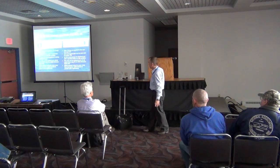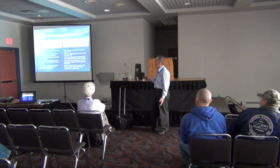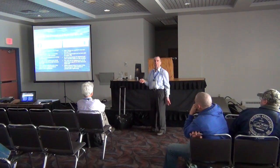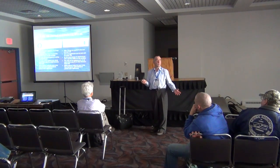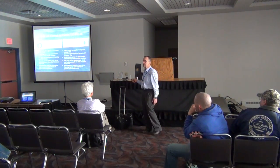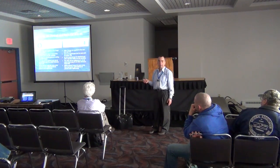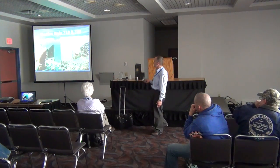Moving over to the 730 slip-on series — it's the same type of thing. Is NSF-61 a concern in this part of your state? NSF-61 is a material standard used to ensure that the product is good for potable water applications. You're probably going to run into it if you haven't already. Most of our product now has to be NSF certified. Our product is NSF-61 certified material, which takes the worry away from improperly used material on potable water applications.